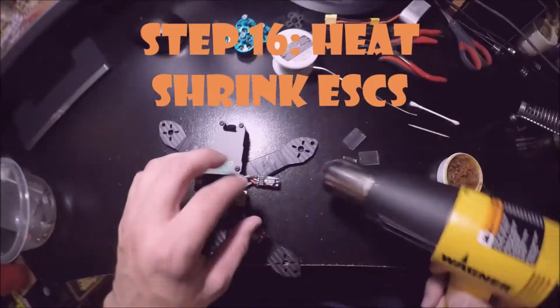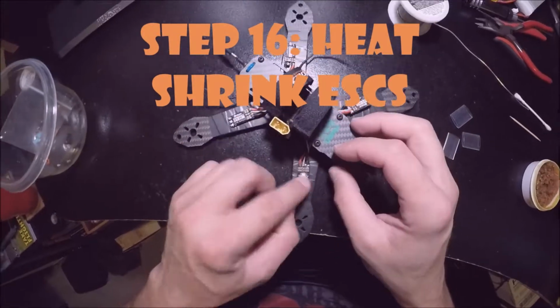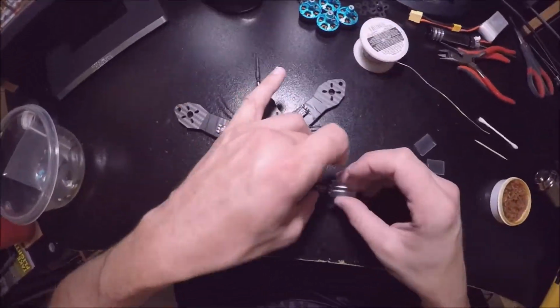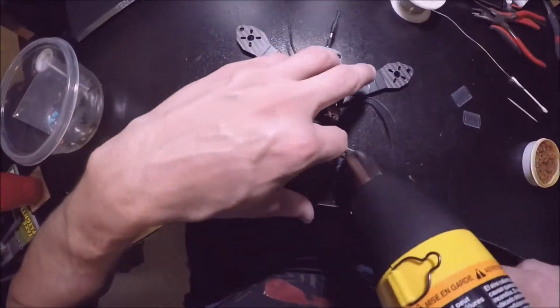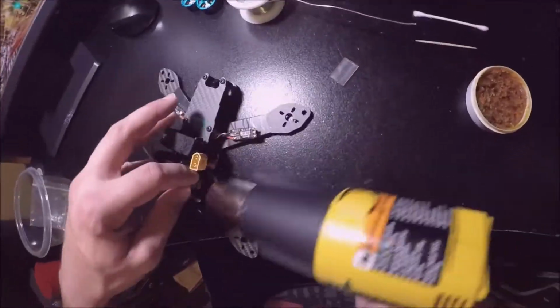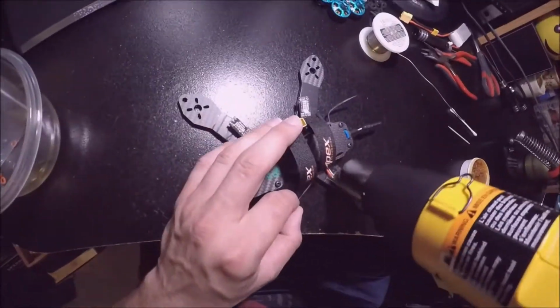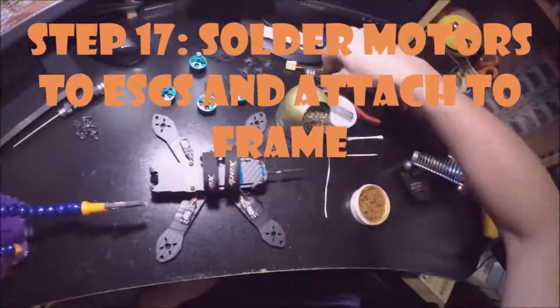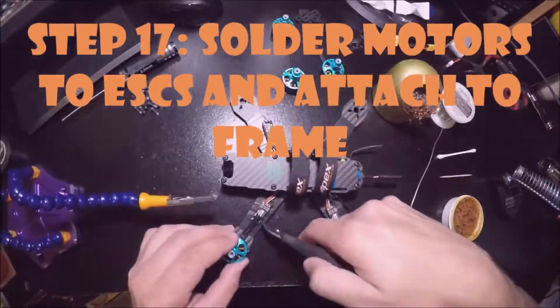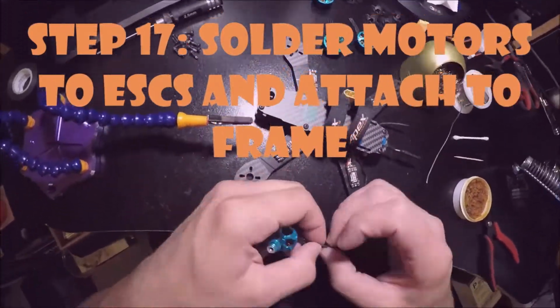So moving on to step 16, guys, we're going to be heat shrinking our ESCs. So again, at this point I'm grabbing some more of my clear heat shrink and adding that to the ESCs. Now the way I do this, and it's the way a lot of ESCs come factory, is they use clear heat shrink, but they leave the motor pads exposed, so you can still solder the motors on without removing the heat shrink. So these had been modified a little bit, so they didn't have the original clear heat shrink. So I basically just added that back on.